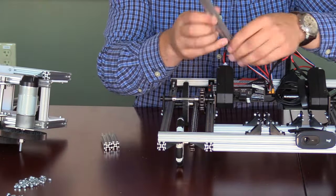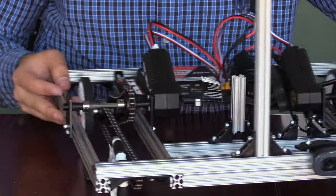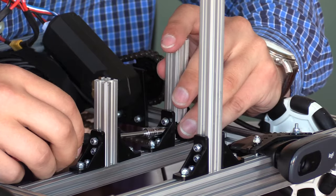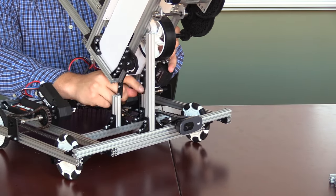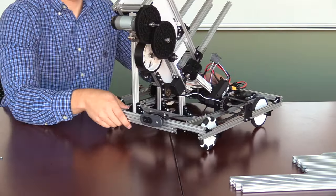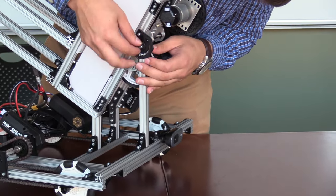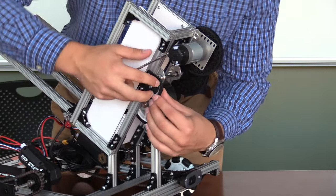In order to finish the entire assembly, we will next need the 19.1 cm piece of extrusion and the two 6.5 cm pieces of extrusion. Here, I am mounting the entire shooter to the chain drive base documented by Rev. If you haven't already built your own drive base, you can find documentation on how to build the chain drive base on the First Global website. The piece that used to hold the front battery plate can be removed, and then you can slide on six of the inside corner brackets. You may need to attach these with T-screws. Next, you will slide the two pieces of 6.5 cm extrusion onto the back portion and the one 19.1 cm piece of extrusion onto the front portion, making sure that the two pieces in the back are a certain distance apart so that they correctly match with the back of the shooter, and that the front piece of extrusion perfectly aligns with one of the two back pieces.